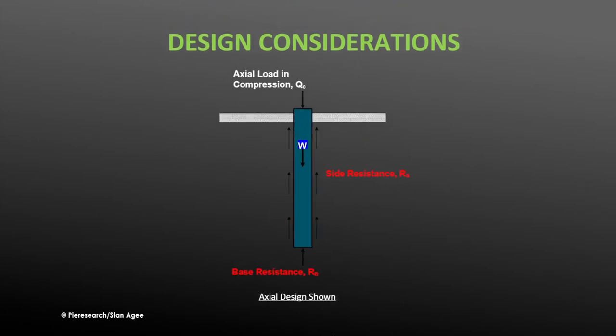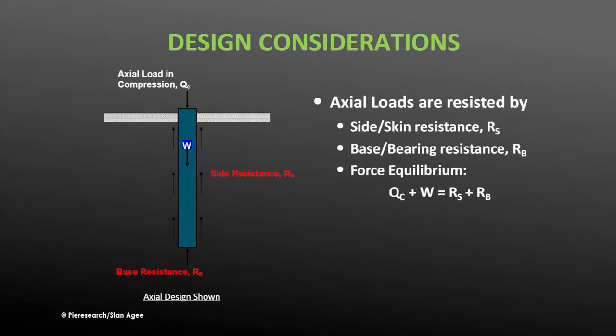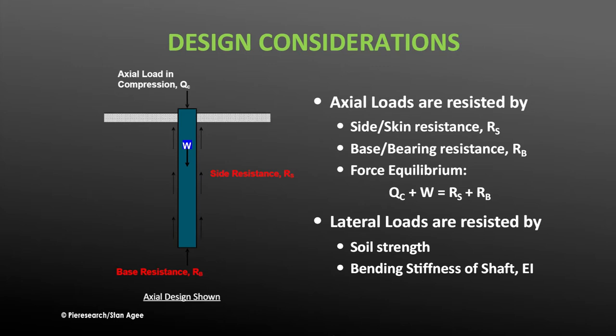Designers rely on foundations to hold buildings up or down. The reinforcement inside a deep foundation holds the foundation together and strengthens it to full capacity. The location of the reinforcement behind concrete cover helps protect the integrity of the reinforcement, primarily against corrosion. As loads are placed into foundations, they are transmitted to the soil through the friction of the pier and the surrounding soil, and through the pressure against the bottom of the shaft. In order to carry force to the bearing end, the pier acts like a column inside the soil. When subjected to tension such as high winds or as the result of an earthquake, a straight pier shaft resists uplift through skin friction, and the reinforcement needs to stay intact to take the forces.